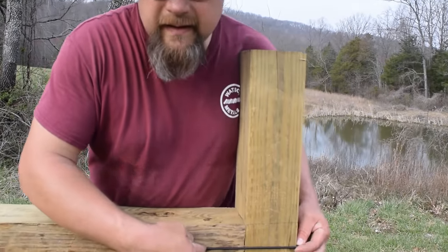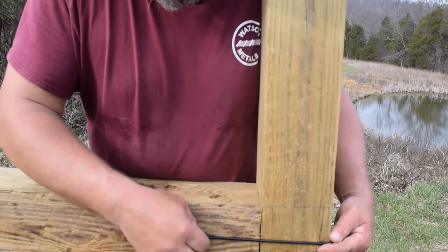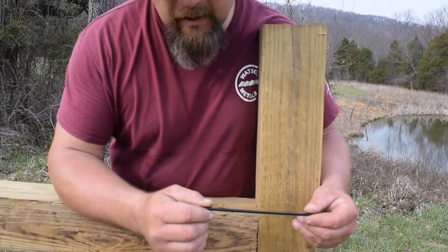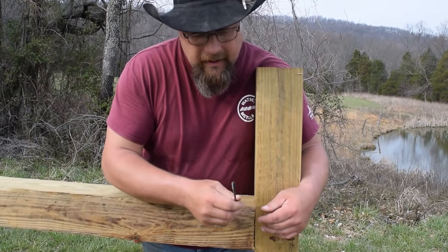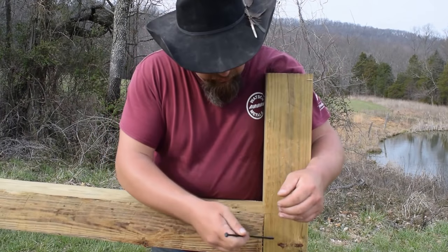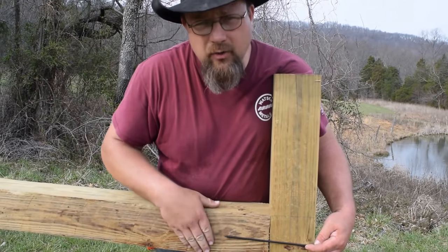As you can see, we have five inches through our post and five inches into our brace. This is plenty enough to hold this brace in place once we get the wire on it. Now, if you're concerned that it might break or sag over time, you could put two in there. These are used to hold log cabins together — placed at about every 16 inches, and you can pull a log with a considerable bow in it down. These are very strong, and it eliminates having to put a bracket on your post system and put nails. This just compacts everything down to one item instead of nails and a bracket, and you don't have to worry about nails rotting your post out. Five inches through our post, five inches into our brace — it works very well.